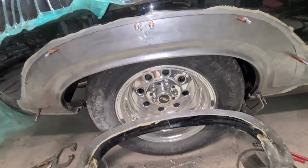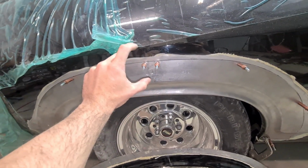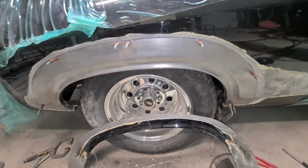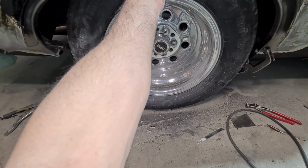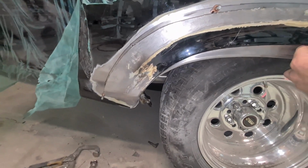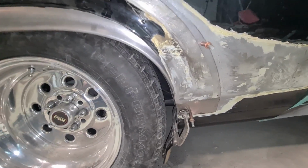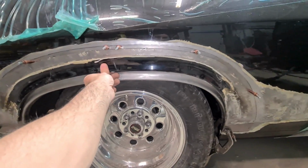So that's how I figured out how they've stuffed up the body line distance to the arch being 30mm short. Yeah, they've just cocked the pieces up when they've welded it in. To give a comparison of the height, where I've cut it out is about there. And yeah, you can see that the arch, they've just cocked the angle up from the bottoms and really stuffed the center up by doing that.